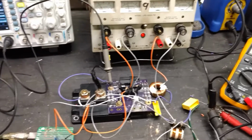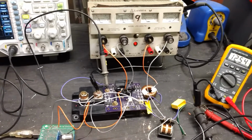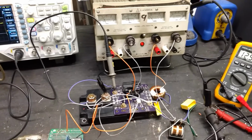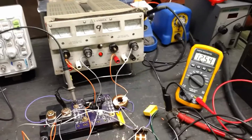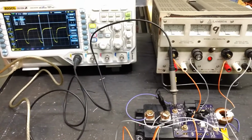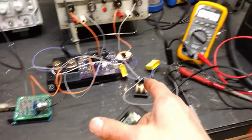But yeah, you have to do either 2 IGBTs in parallel, but one is backwards to the other, and they have to be IGBTs without the anti-parallel diodes, or you have to use 2 MOSFETs in series with the sources tied together, so they're technically facing the opposite direction. That's to get rid of the anti-parallel diodes as well, but also be able to conduct in both directions with AC. So it's going to have 2 switches on the input and then basically 2 diodes in the output.